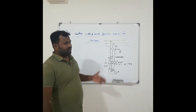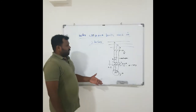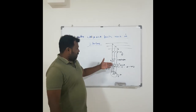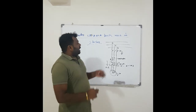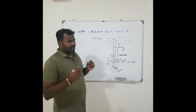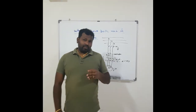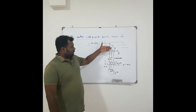If you don't use a circuit breaker, what will happen? Your motor is 5A, so the contactor and overload relay are selected as per the motor full load current, and the cables and other components in the circuit are also sized accordingly. When a short circuit happens, the huge current will flow and within one or two seconds it will damage or burn all your components. So the circuit breaker senses and trips, isolating the power source from the main grid immediately.